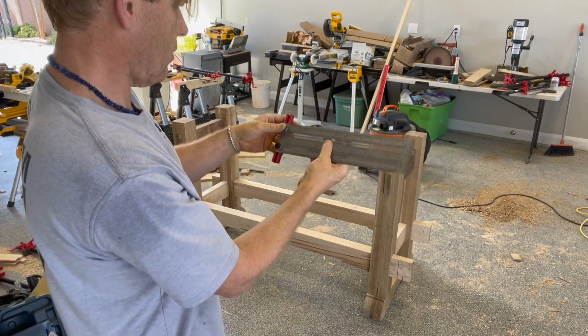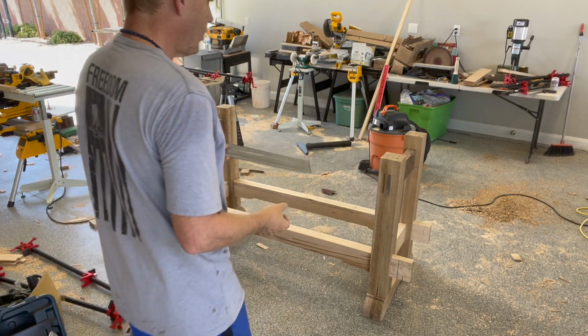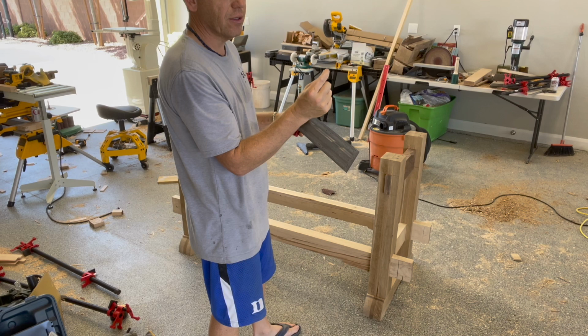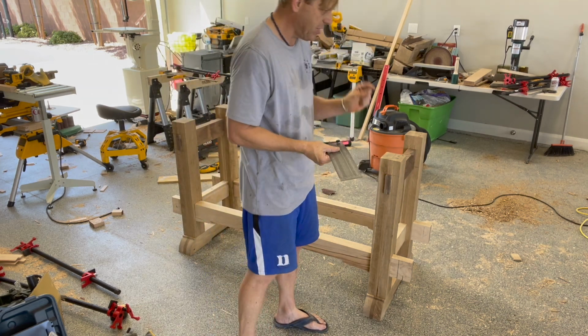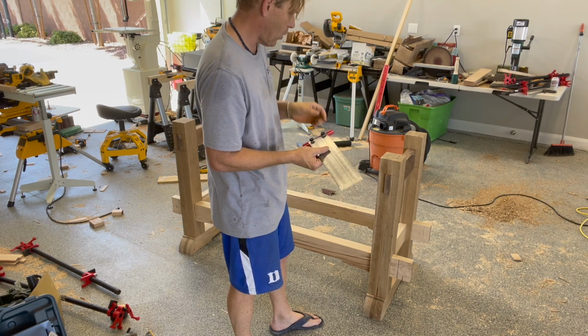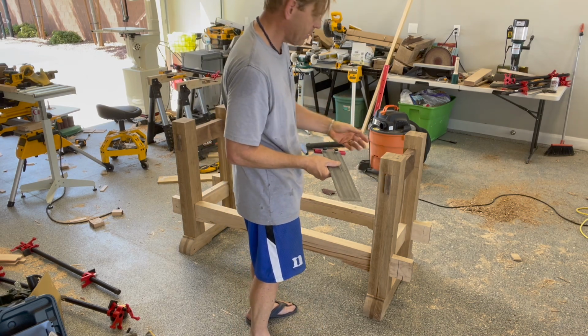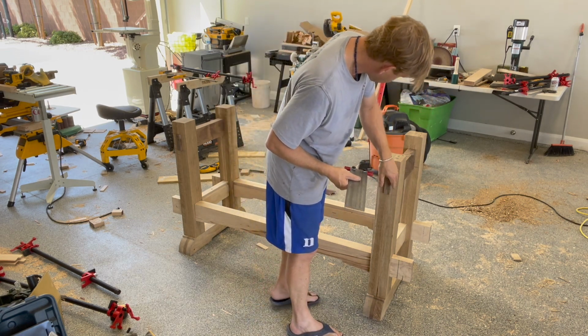And that's how I laid out all the tenons, and it really paid off, because what I learned on these through mortises at least is that even just a little sliver, if they don't come through when you go to put them through, just the slightest of shaving will free it up. So you really have to take your time and not get too aggressive and try to figure out where it's hanging up. Some of these are pretty good.